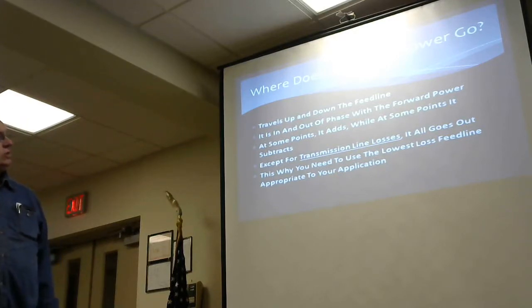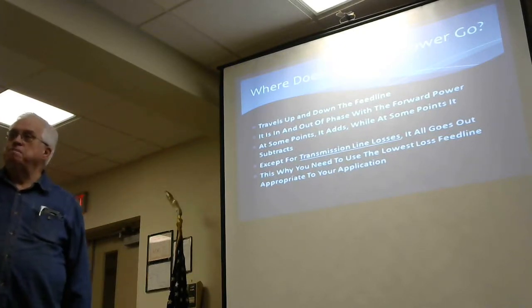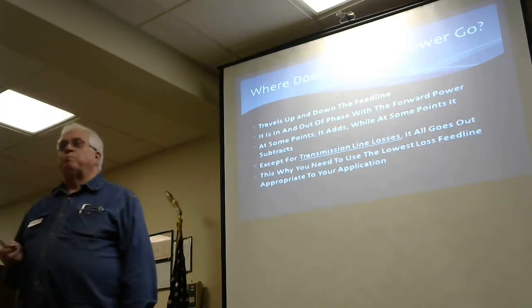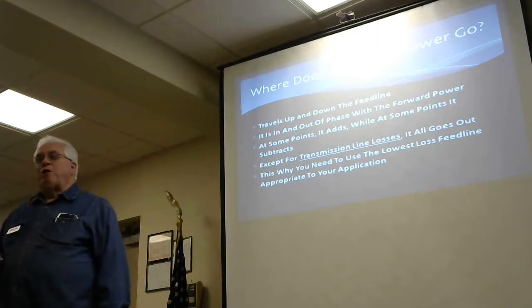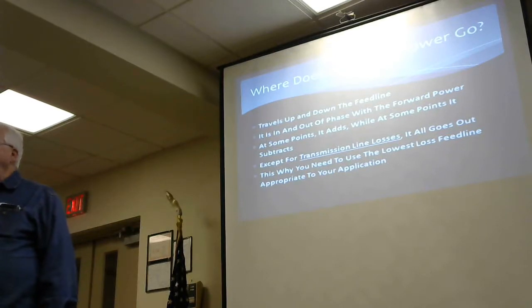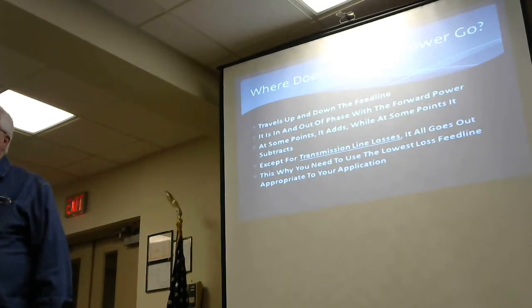I'm going to give you another example of a tuner that's part of the antenna. Any AM broadcast station, they're limited on tower height by where the nearest airport is, where other things are around it. And Gary, who is a broadcast engineer, he'll tell you that the base of all of these AM towers has a big loading system on the bottom, because they're using what they're allowed to use, but they got to load it to the frequency they're using. Another form of tuner. Go ahead, Andre.